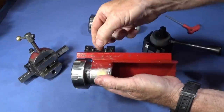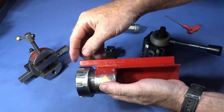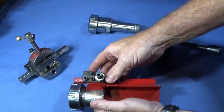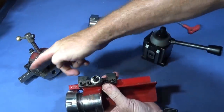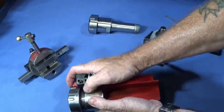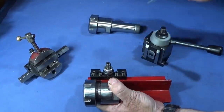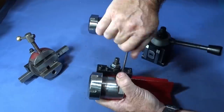And you can see that I've designed it with an overhang to the front of the collar, and I had to grind that out before I screwed it onto the angle iron. That's so it can go into the tool holder and give much more room on the cross slide, like the toolpost vise with the long bar on the back. You can move it up and down in the tool holder and have it back as far as that, giving much more room on the cross slide for whatever you're going to machine.